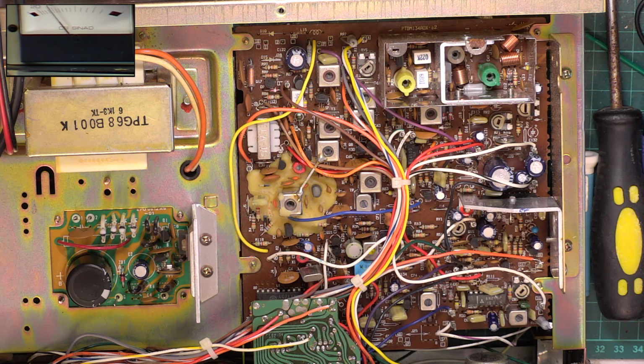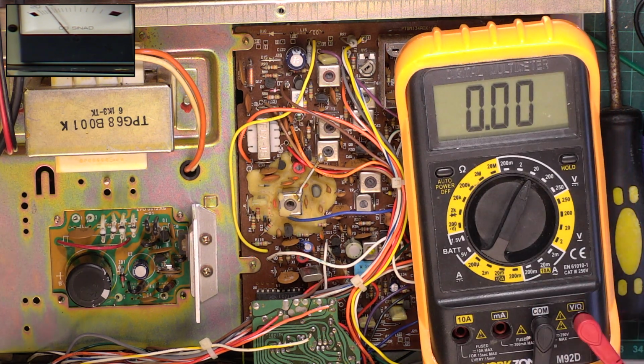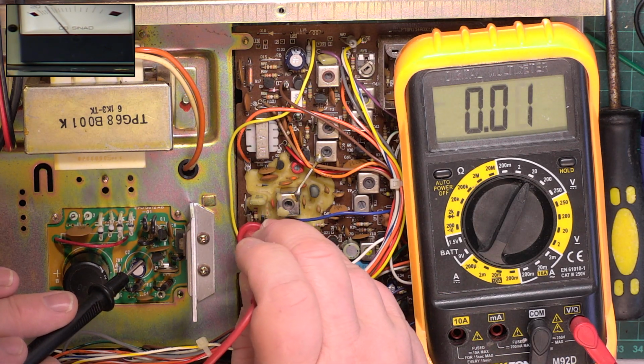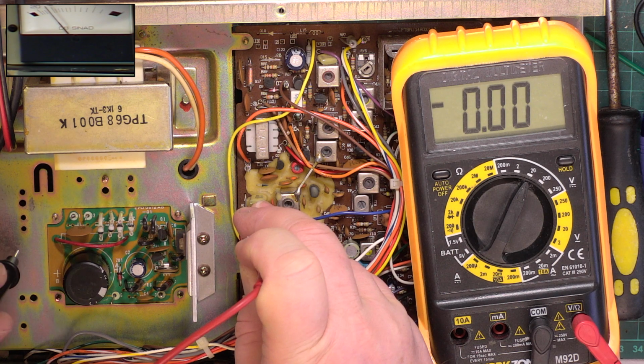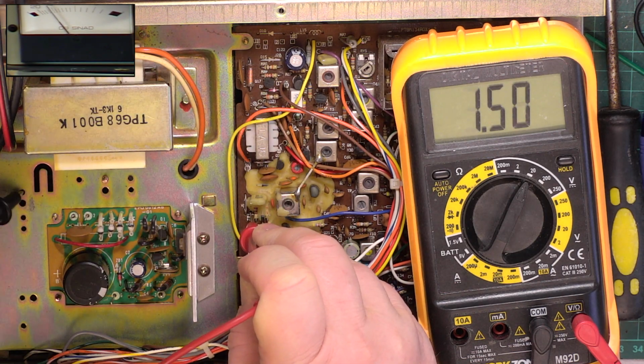Spot on. We're just going to alter things a little bit. Might get another 100 yards out of it. So we're going to check the VCO because I don't know whether he's done that. So channel 40. We'll plonk the meter in the works. Top end of resistor 4. Is that chassis? Do you know what? I think chassis is chassis. We'll just check it against the can. Yeah, makes it easy to service.